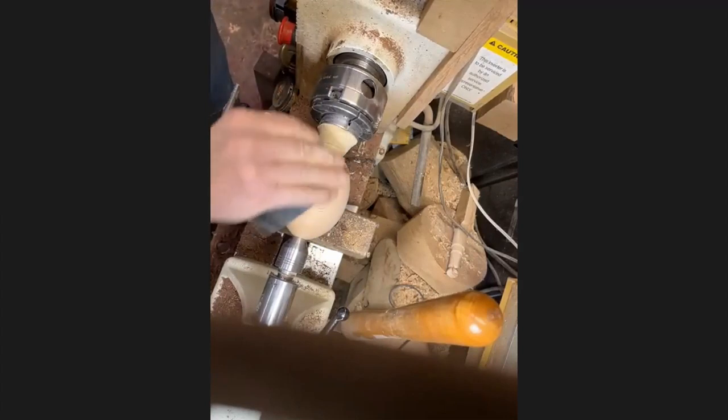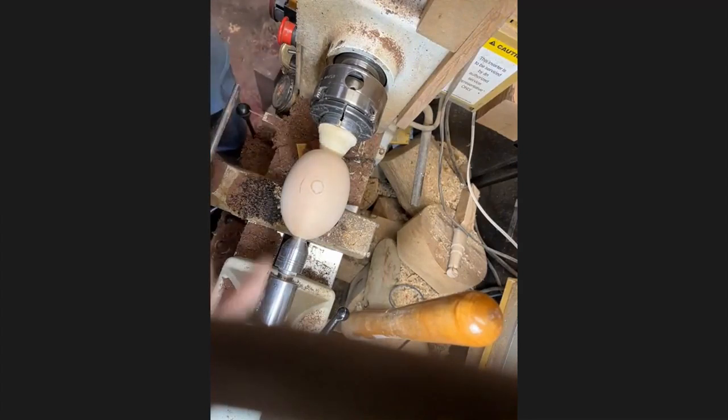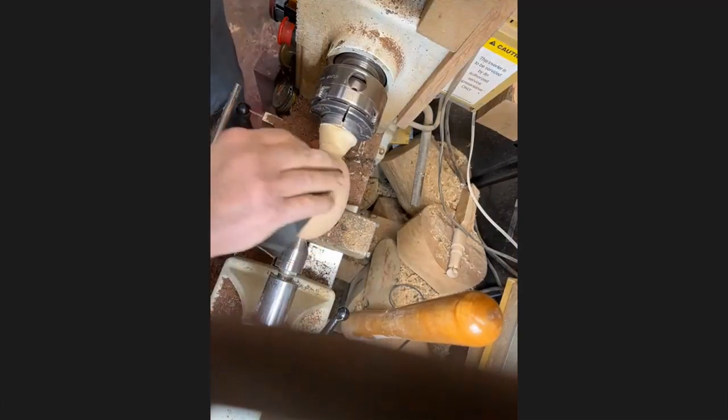But you can do your gallery finish work very quickly with this little stuff. And when I'm doing this, I'll make 10 of these at a time, so that when I have this cone on, boom, I run 10. Every operation I'll run 10, and I'm not just constantly changing all this equipment on the lathe.